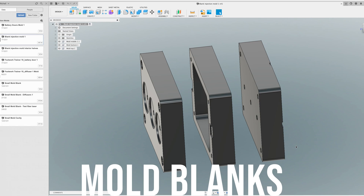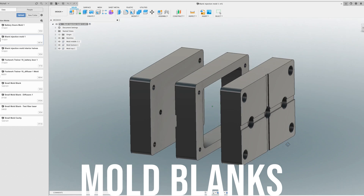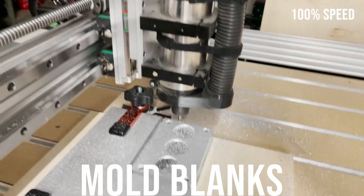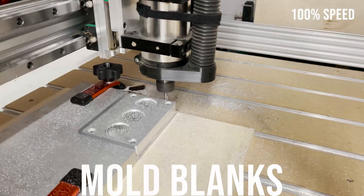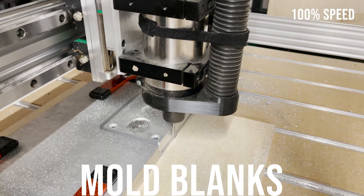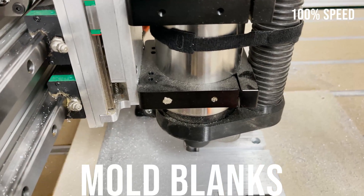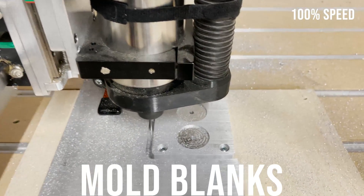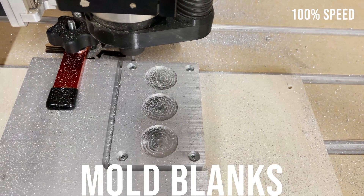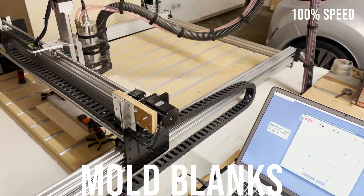Here's where I really pushed the Workbee to its limits. I bought this used injection molding machine and I wanted to make these blank aluminum molds where I could use my resin printer to print the real mold inside of it, and this would contain it and support it from the pressure of the clamps. Cutting these out of 1 inch aluminum proved to be a challenge — as the bit got pretty deep in there it was generating a lot of heat and I had a couple of failures where it would just gum up in the aluminum, but I eventually got through all the pieces.